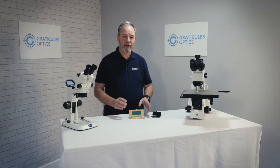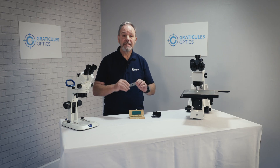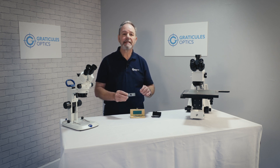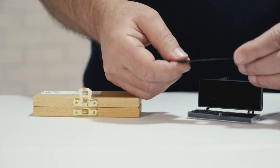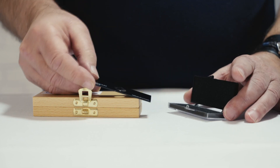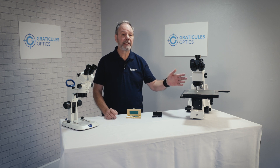I've got a couple of stage micrometers here. They're the same size as a standard microscope slide. On the glass disk we have a small precision fine line scale image. This professional stage micrometer comes in its own wooden box with a unique serial number, which makes it ideal for certification as an international calibration artifact. My second stage micrometer has an identical pattern on the glass disk but in the center of a lower cost black aluminium carrier. The advantage of these carriers is durability should it be accidentally dropped or damaged. Stage micrometers come in different sizes and lengths, and you should choose a scale that best matches the scale of your reticule and the object magnification you're using.